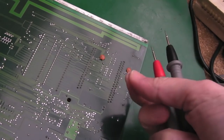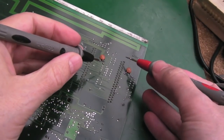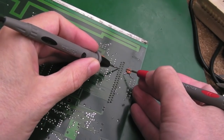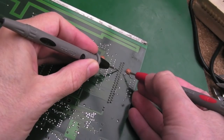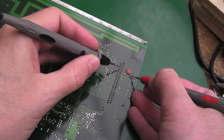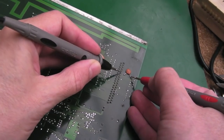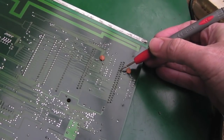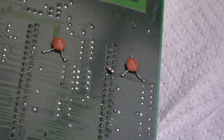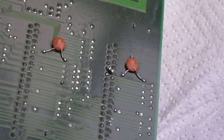The final thing here is the bypass cap - I'm going to use the original one that came off. This side has got one, and it was the fifth pin down. If I measure to the cap there you can see we've got a short - that means that's the positive. Okay, where's the ground? The ground's the other side of that cap there. If I measure here we've got the short - so positive here on that pin, negative on that pin. If I put that ceramic cap in between these two pins here and just reflow the solder, the cap will be in just the right position. Yeah, that's fairly tidy - diagonal between VCC and ground, no other shorts around there.